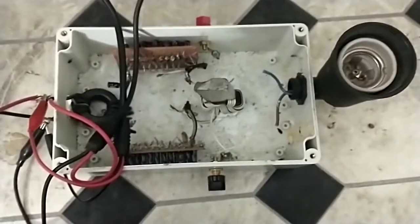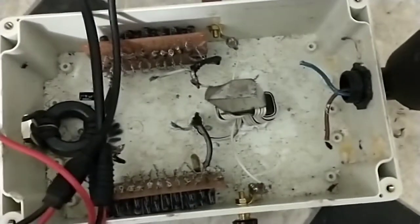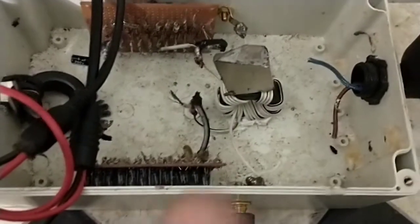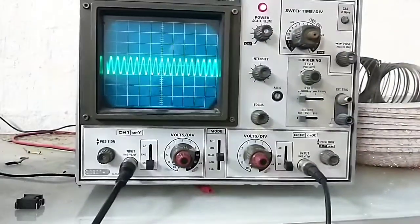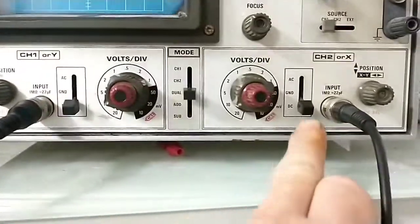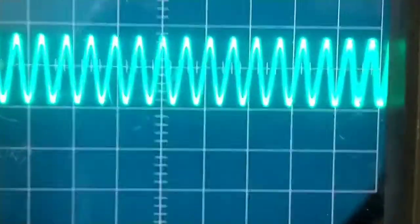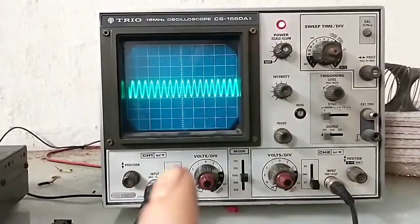This configuration is not permanent. My input is through an isolation transformer at the moment. The output is kind of like a Tesla bifilar pancake coil but on a toroid, except it's a twin — there's one from each side working inversely and then outputs. My scope is old and dodgy, so at the moment I've got both channels on the DC scale. What I'm showing is that I've got it set up so that both of the waveforms are on top of each other, so you can see they're at the same mean voltage.